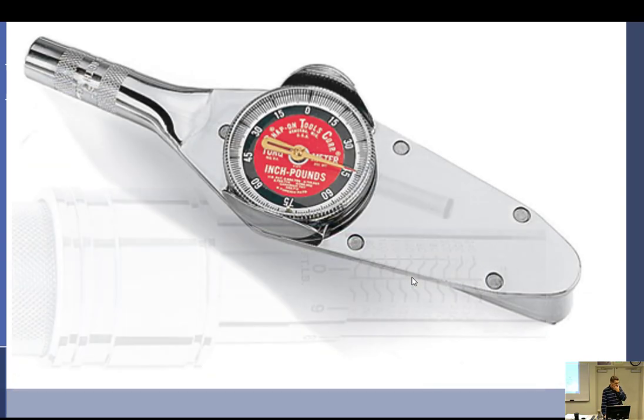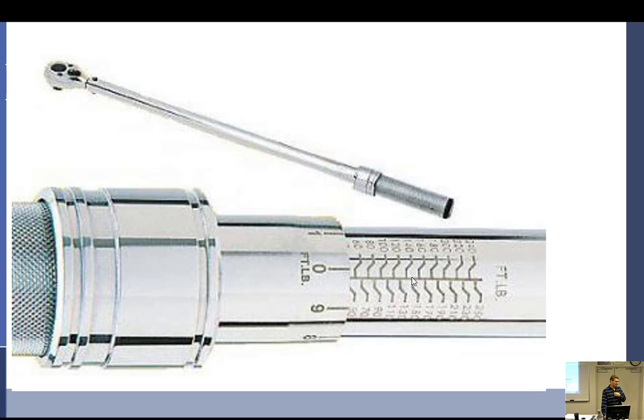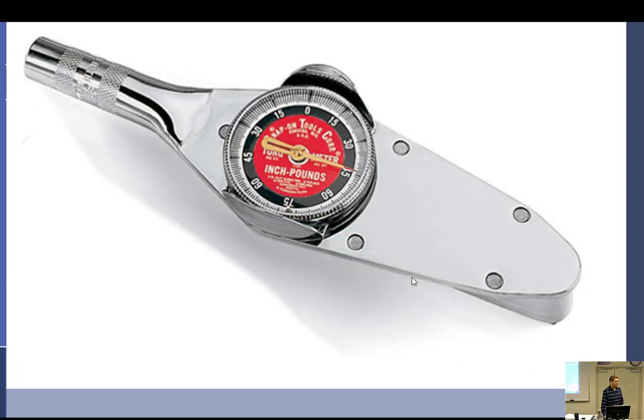Other than the click type, which would you recommend? I love click types. I dislike the dial type with a passion. I hate these — especially this one here in foot pounds, or inch pounds. It's Snap-on's fault. The effect of length isn't correct — they're too short for how much they go up to. When we're doing engines and going up to 600 inch pounds on cylinders, it's very short. You're shaking and the needle's bouncing. You should have a nice long one, and you've got to get your face just right to read it.